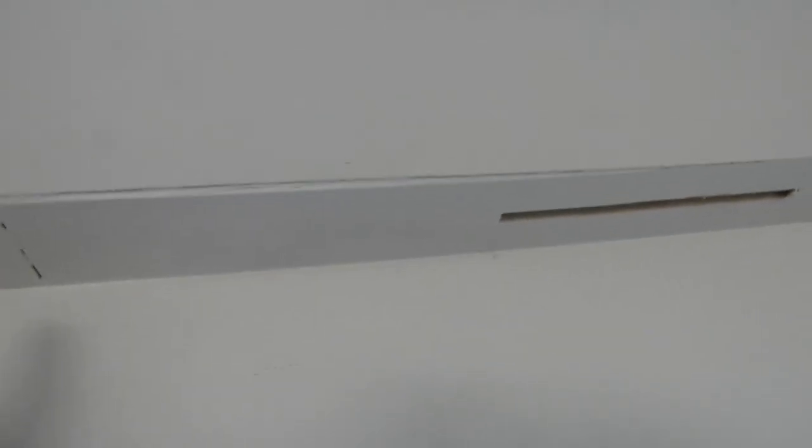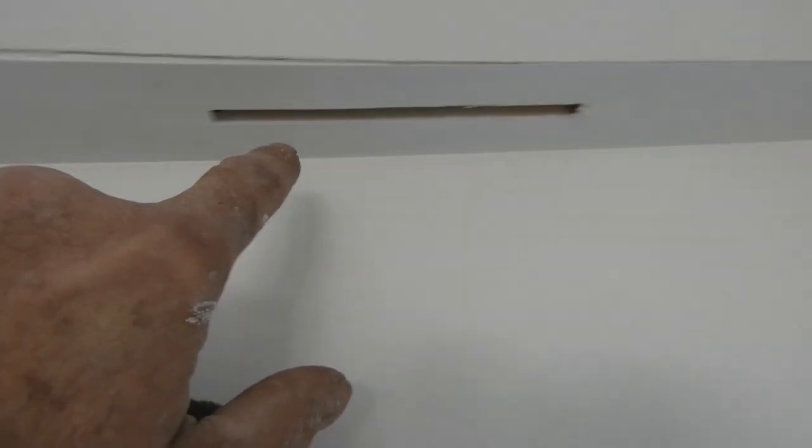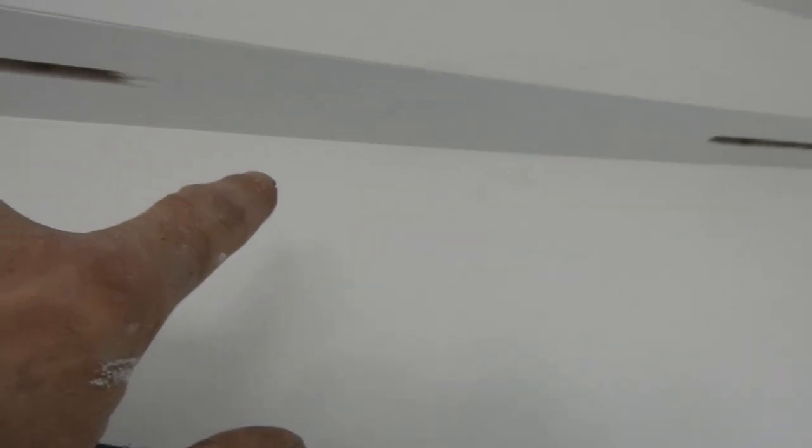There's our kind of crown molding, so to say, to help hide the PEX. I vented it on the bottom. I slotted it with a three-eighths dado every two feet. I started at one foot and then went one, three, seven foot and then just to get it to our joint. There's our joint right here. So we started it, came in one foot and then went three foot, then five foot, and then it's seven foot on the eight-foot pieces. That's to hide the PEX and let air get to it.